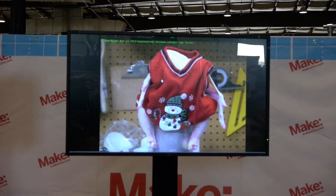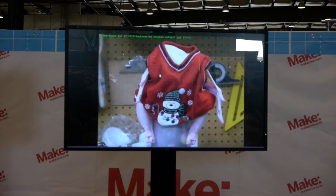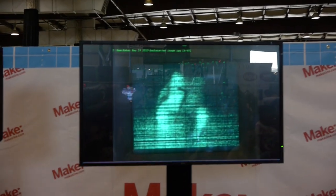This is a project I built last fall — well, I didn't build the frozen chicken wearing a sweatshirt, but I built an airport TSA backscatter X-ray scanner. Up until about a month or two ago, if you went to the San Jose airport you'd get a backscatter X-ray scan. The machine sends X-rays toward you and measures how many reflect off your body. If you're hiding a piece of metal under your shirt, the X-rays are absorbed by the metal and don't reflect, but they do reflect off flesh and water. I took an X-ray image of that chicken — you can see the legs and where the head would be, with a little crooked piece of metal hidden under it.